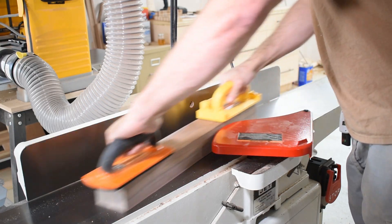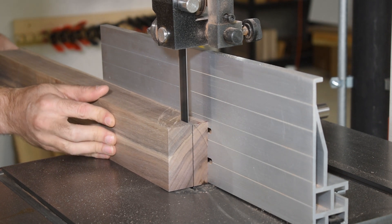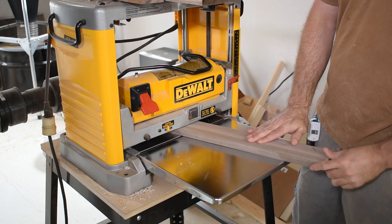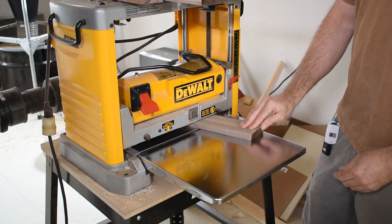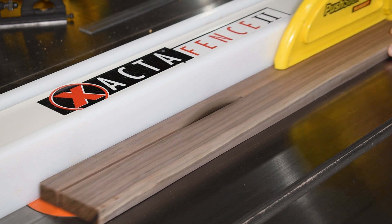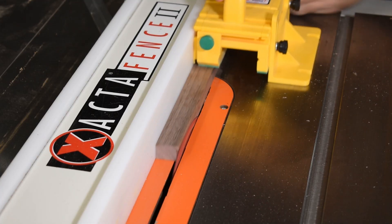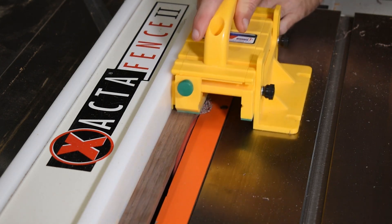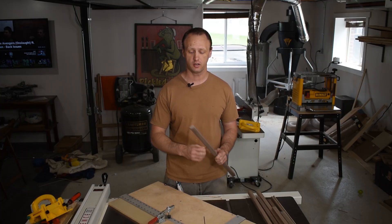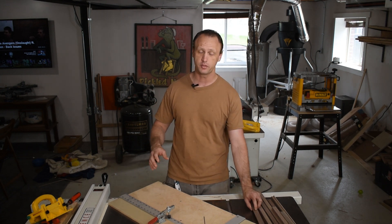The cabinet will display four comics housed in picture frames. The comics are the main feature, so I'm starting the project with the frames, which will then allow me to determine the size of the back panel and in turn the cabinet itself. I cut the frames one inch wide; the rabbet is three-sixteenths of an inch wide and a half inch deep. This ensures that the frame doesn't cover too much of the comic cover and leaves plenty of space for extra thick issues. I cut all the rabbets on our board. Now we're going to cut the pieces to make the picture frames using my picture frame sled.